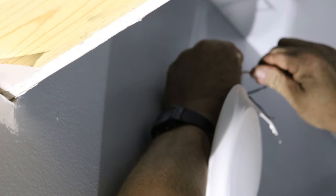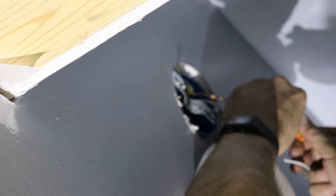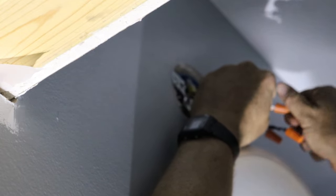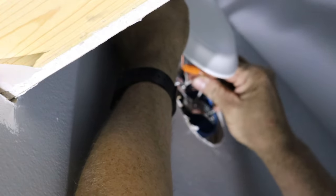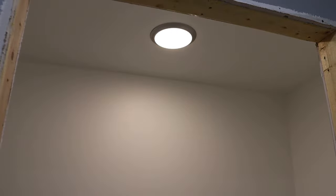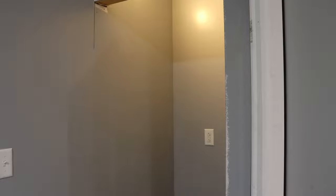I'm actually not going to show the light installation because I had to get a little bit creative with both lights. As long as you follow the instructions and get to the point where there are essentially only three wires — a hot, a neutral, and a ground — coming out of a light box, you'll be able to hook up a light. There's the light in the office and the light in the closet. I put the light on the wall instead of in the ceiling because I'm going to be building some organizers to hang things from the ceiling. With those lights installed I'm kind of over a hurdle, and I'll be putting out more videos on electrical work and another one on welding, and I'm going to get my air compressor reel installed. So watch out for those — we appreciate you watching.